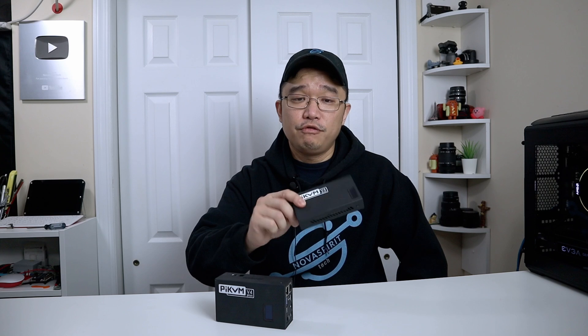The new feature on the Pi KVM V4 Plus board is LTE — cellular network. This add-on board gives you the ability to add a mini PCIe modem and a SIM card, so when you ship this to any client, as soon as you plug power into it, it will get a cellular signal and you'll have internet access to it. They also added a barrel connector supplying 12 volts at 2 amps, which resolves a lot of the power issues the Raspberry Pi 4 had that required a specific 5.1-volt USB-C supply for best performance. And because it's now running a CM4, it's low profile — smaller and easier to carry.